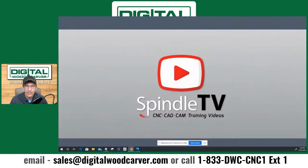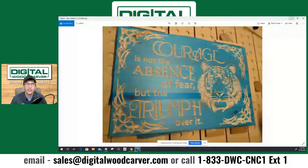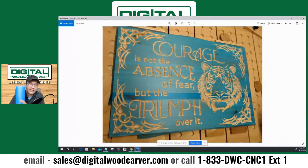some of the prep materials are things like Oramask. Oramask, in my case, Oramask 813, is a stencil film. It's perfect for protecting your material. It's got an adhesive back on it, so you can cover your board, like we see in the picture here, prior to carving, and it cuts beautifully. It creates a nice stencil, if you will, that you can paint, and when the paint dries, just peel and finish the project.